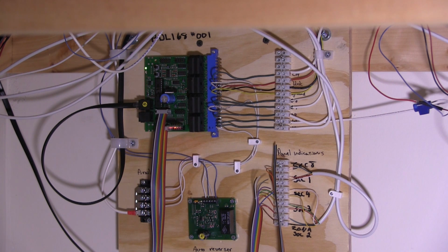There's the lettered pins and the numbered pins. As you're assembling it, every single wire goes through both the A pin and the number 1 pin, and the B pin and the number 2 pin, and they have to get to both rows and get soldered. The only exception is that ground wire. That only goes to the M pin.